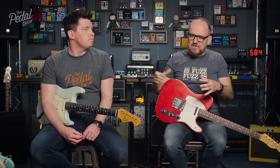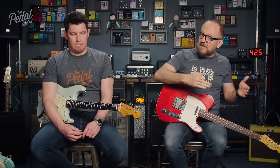However, if the third pedal in that signal chain is buffered, then that's going to be driving everything after that, and you're only going to be driving things before the buffer. So, for example, Boss pedals, Ibanez pedals, there's lots of pedals, Klons are a good example, that in their bypass state are buffered, right? So they are already changing that impedance. But if you've got a big pedal board with lots of pedals all chained in series and they're all true bypass, the fact of the matter is you're going to be losing some signal in that signal path.